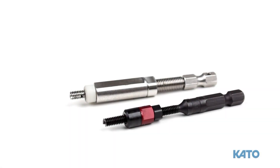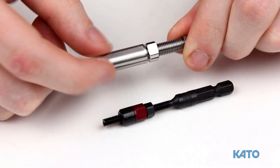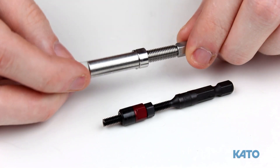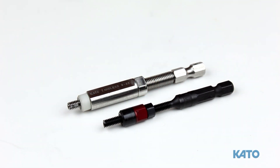The final component is the installation mandrel assembly. This is the part you'll swap out for different insert types and thread sizes. The Kato Hex Electric Tool can install both tangless and tanged inserts. Here we have two different mandrels — this one is for tangless, and this one is for tanged. Here is the adjusting sleeve that will control the installation depth. Use the lock nut to tighten the adjusting sleeve. The tang tool also has an adjusting sleeve and lock nut; although they look different, they function the same way.